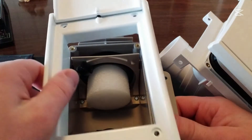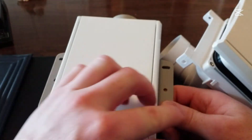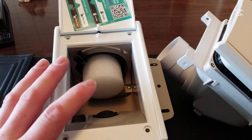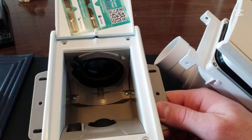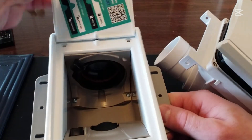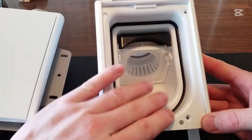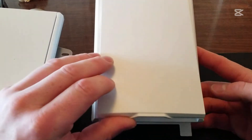The Chameleon door is purely cosmetic, which means that even though the Chameleon has been the biggest promoter of using the retractable hose elsewhere in the house with traditional valves, to do that you must order and install a separate flat piece called the cam port and close that against the valve body surface — because closing the door will not seal the valve body. Interestingly, even though Hide-a-Hose never really promoted hybrid system use, its self-sealing box would allow you to do that more readily.